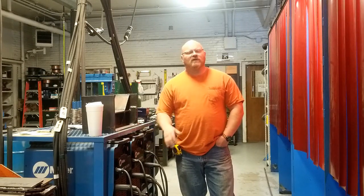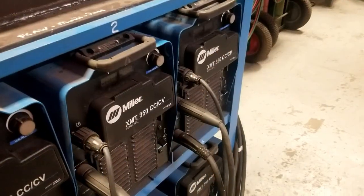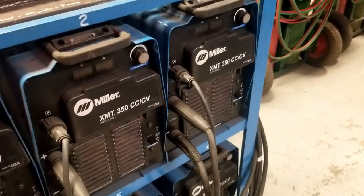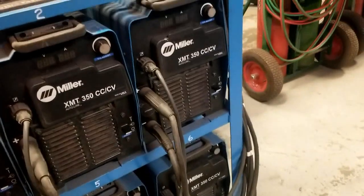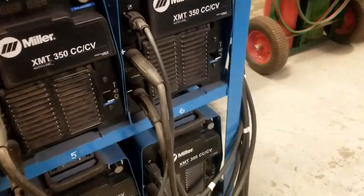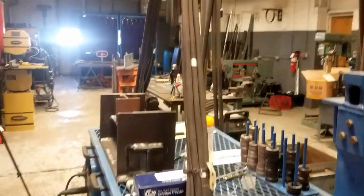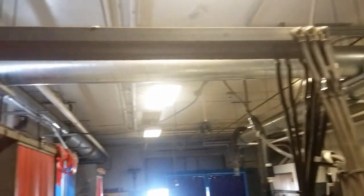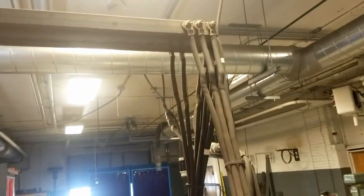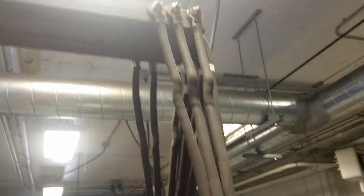That'll keep this video a little bit shorter. So with that having been said, let's go ahead and get started. Right now we've got a look at the power supplies. They're in a bank — there's six of them here in this particular bank. The cables are all lashed together and they go up to an arm. It's a large piece of channel and that's where all the machines are grounded. The individual grounds are more or less permanent on this setup.